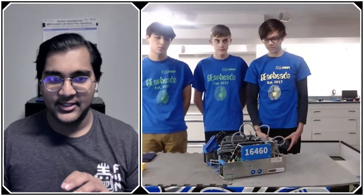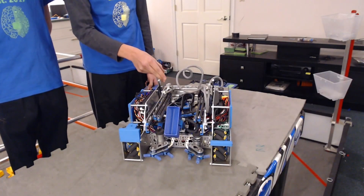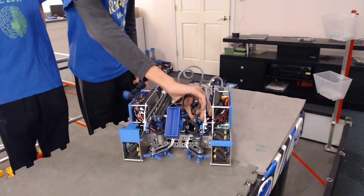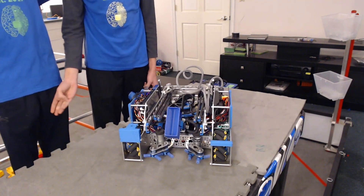Talking about the extension itself — are you using MGN9 linear rails? Yes, these are MGN9 linear rails. We originally used these because we couldn't find 350 millimeter drawer slides and would have to board the 300 millimeter ones, but we found these are better than slides in some ways. We can make the first stage longer than all the others, and because the only moving weight is the carriage, this saves effectively two-thirds of the weight. It is very rigid in the up and down movement, which is what we need for both the deposit and the hang.